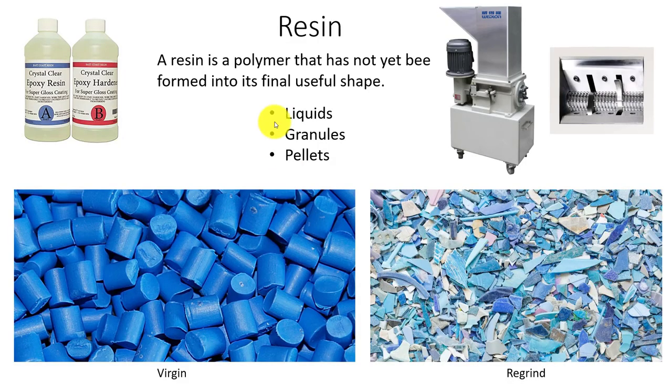In the lab we're going to be working with granular virgin resin material. If we grind up runner systems or misrun parts using a machine like a plastic shredder, we can mix maybe 20–30% regrind with virgin material. If you process 100% regrind, the properties will fall down because every time we heat and process that plastic, the thermal history allows for polymer degradation. To get near-virgin properties, we slowly integrate regrind into the virgin materials.